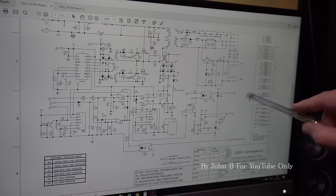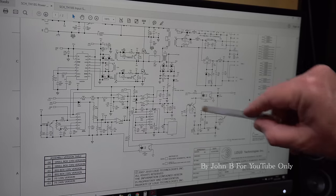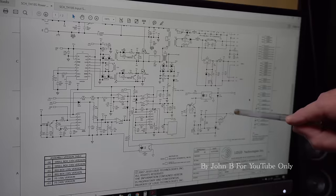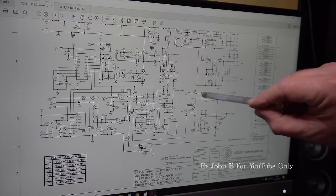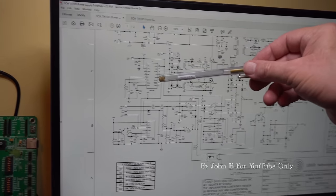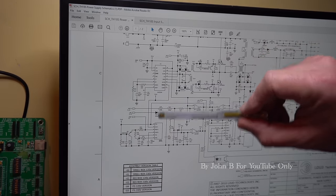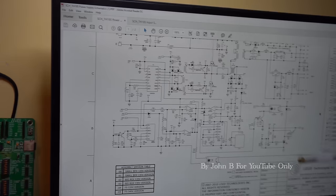But then going back to this limit, which is here, I thought, another opto-isolator, same as the Wharfdale. I ended up chasing that around for a lot of hours. So this is 6 hours later, I've discovered what's happening. This opto-isolator is grounding that line. Now, we use the opto-isolator because they've got different ground references on here. On the power supply chip, this would be like plus 12 volts and ground. But this ground is half of the mains potential, so you can't take this ground and just ground the plus and minus 15 ground, the different potentials. So that's why we use an opto-isolator.